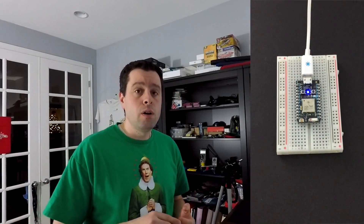So we're going to start that, and we'll cut away to that right now. On the first day of our project, all we're going to do is get our Particle Photon set up and ready to go for day two tomorrow. The first thing we're going to do is plug it in to our laptop with the USB cable that comes with it. If it's a brand new Photon you've never used before, the blue light will start flashing — that means it is in a mode ready to accept credentials to connect to a local Wi-Fi network. It is waiting to receive instructions.